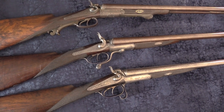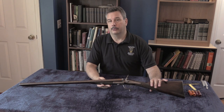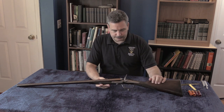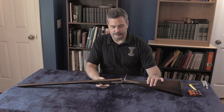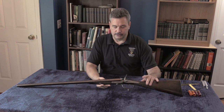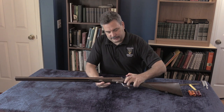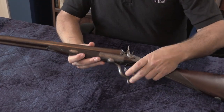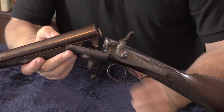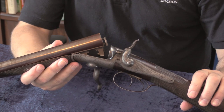They're all beautifully made guns, about 140 years old. This is a double-barreled shotgun from the memorable firm of Williamson & Sons, who, despite the similarity of names, is not related to me. The proof marks put this sometime before 1875. It is a cartridge shotgun, so it's after 1858 when Charles Lancaster invented the modern shotgun cartridge. One of the key points is it has non-rebounding hammers — you have to have the hammers at half-cock to open it. This went away when the rebounding hammer was invented in 1867, and everyone moved to those very quickly because they're much safer.